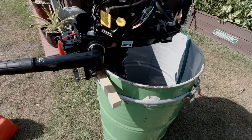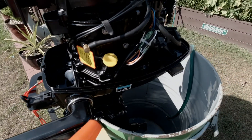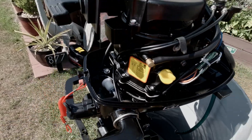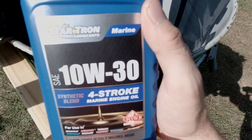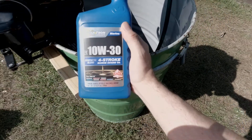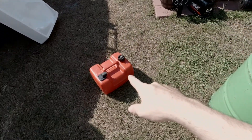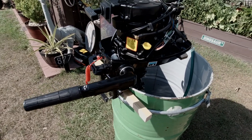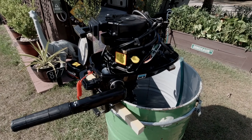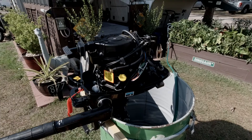I've got the mount in my bin but haven't put the water in yet. I located where the oil goes — right here — and it comes with this little funnel. The oil I'm using is what they recommend: 10W30 four-stroke marine grade for marine motors. For fuel, I'm using supreme gas, which they recommend — supreme or ethanol-free, whatever you can get your hands on. I'm going to hook up the fuel line and try to get this thing fired up.